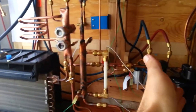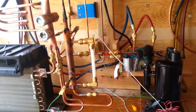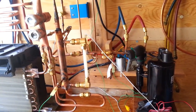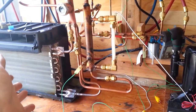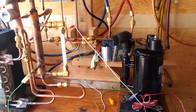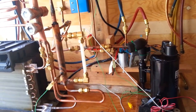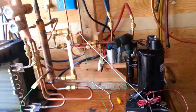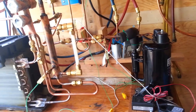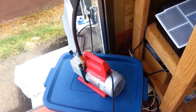By performing this first-stage compression and raising the suction pressure for the rotary compressor by 10 psi, you ultimately reduce the compression ratio the compressor has to perform. A higher suction pressure coming back to the compressor — say we're maintaining 40 psi at the evaporator but the compressor sees 50 psi — means the suction gas drawn into the vanes is higher density. So for each rotation of the compressor there's more mass flow, giving higher volumetric efficiency. That's the intention, anyway — time will tell.